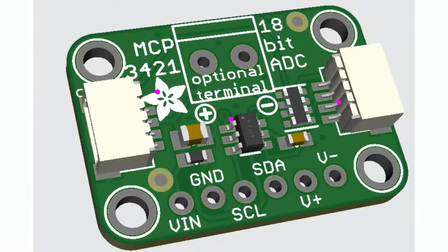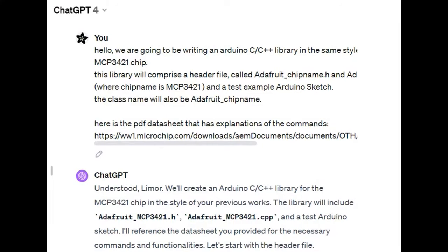Sorry. So this is a PCB design, since it's just an image. Again, the bill of materials is small. I just have a bulk capacitor, a 0.1 microfarad capacitor, a ferrite, and then a couple of 10K pull-ups. But honestly, probably most of these items you're already going to have on your board. So really, all you end up needing is just that SOT-23-6, because again, it can run from 2.7 to 5 volts. You don't even need a regulator for it.